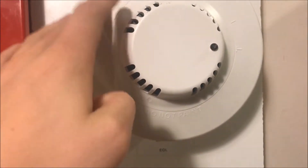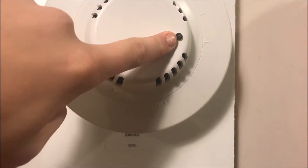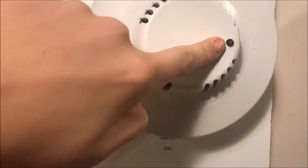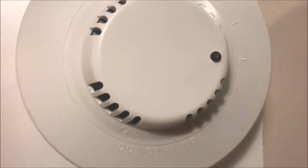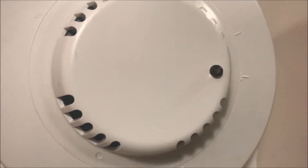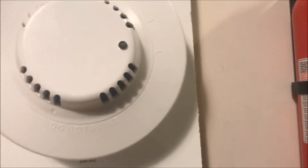You can see it's on a very large base. There's the LED indicator — it's a bi-color LED, meaning in normal operation it will flash green, and in an alarm or trouble condition it will flash red. This one flashes green twice — the first green means everything is powered up and testing, and the second green means the cleanliness is set up and everything's working. Once it changes to red, that means either a trouble or alarm condition exists.